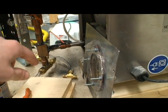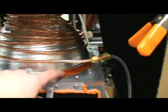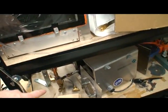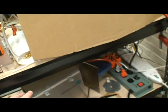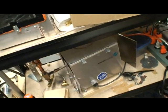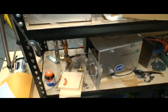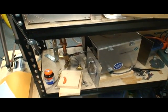That's why I wear a respirator when I run this, because you generate either ash leaks up top, sometimes a leak develops around this seal, or coal leaks around the bottom. You can get puffing coal from inside the hopper if the gases feed back through. So you want to be careful of aerosol dusts. They're not good for your respiratory system.